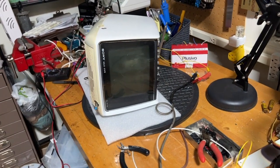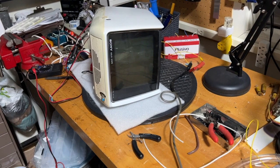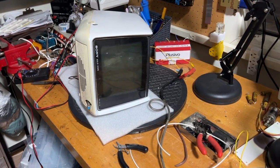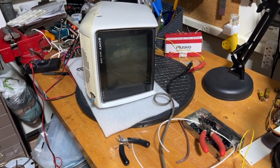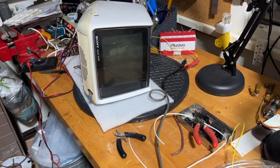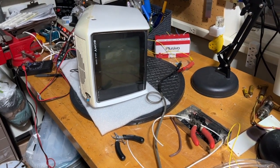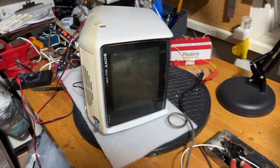So what's causing this? I know it's not the voltage coming in. Generally speaking, when the voltage coming in is low, the picture ends up being too small — you don't have the vertical height or width. You get a small picture, not a dim picture, unless the voltage is very, very low, which it isn't. If I had to take a random guess, the high voltage is not making it to the picture tube. Let's open it up and see how it looks inside.